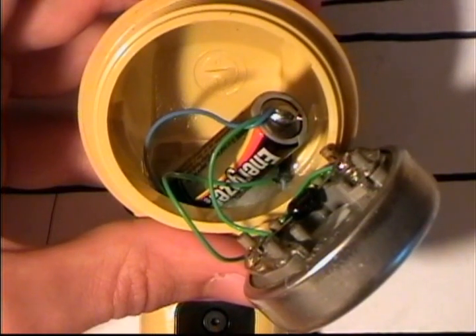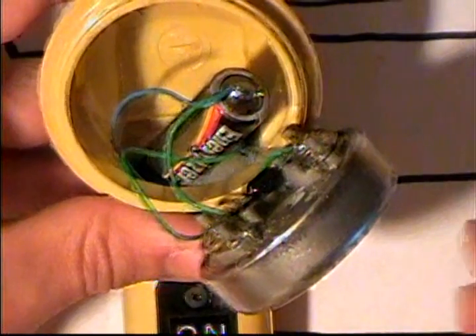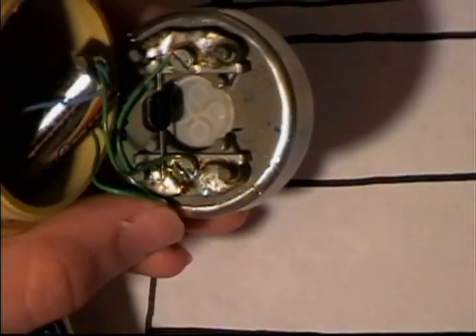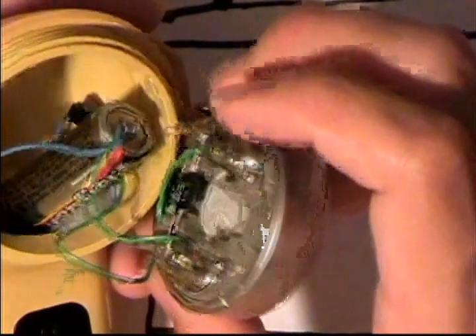I simply fitted the battery inside here — it was able to fit in. It can't go all the way inside unless you use a AAA battery, but it goes in enough that you can put the speaker inside. I also recommend you put the foam or cotton ball that normally sits in there back in when you reassemble it. The wire connections on the speaker are simply screwed on, so the only parts where soldering is recommended are the battery and the switch. You can use a battery holder if it fits, and wrap wires onto the switch terminals if you don't have soldering experience.